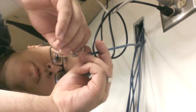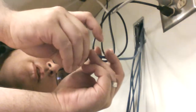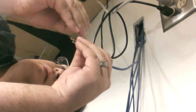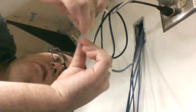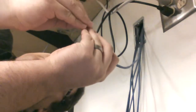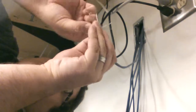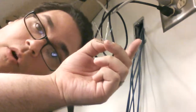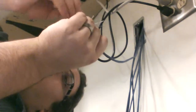So once I do that, I'll separate out the cables and split the pairs — white, blue, blue, white, orange, et cetera. This doesn't take much long to do. And what I pre-do is I'm still trying to keep them together, and the reason being is because when we do this, we're going to pull them through part of the keystone, and I'll show you that when we get there.